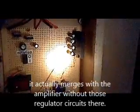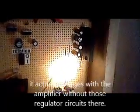And right here are two volt regulators, because without those, the siren circuit's power and the volt regulator circuit's power merge together, and the siren sounds like it's on crack or something. It sounds like it's drunk or whatever. It just doesn't sound right, and it's not very loud. But I managed to split those...